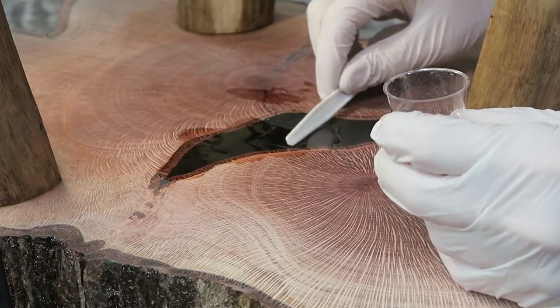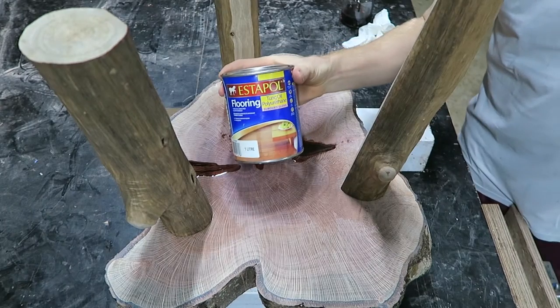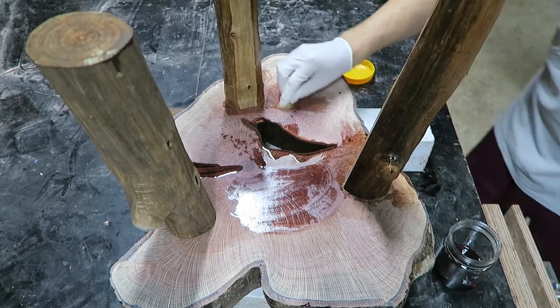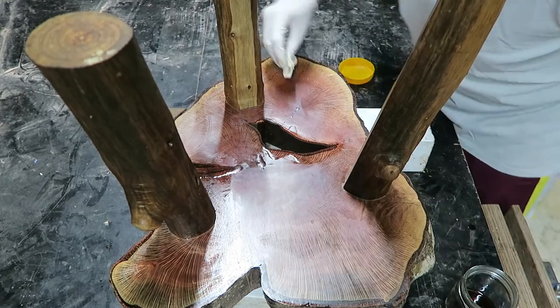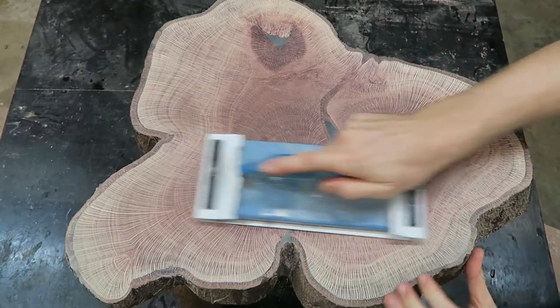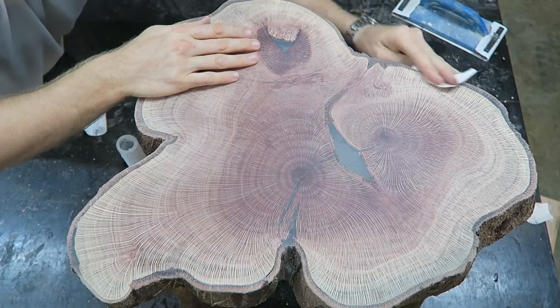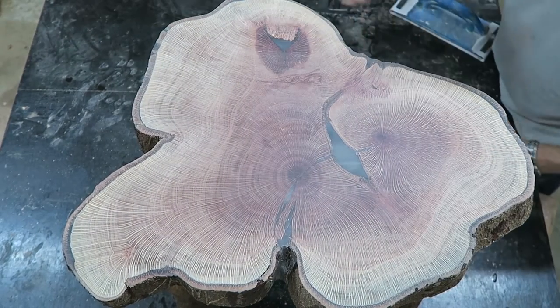To create the glass finish for the cavities, the underside was given a thin film of epoxy over the cast areas. Then the rest of the underside has a normal finish applied generously and burnished off. The top now gets the prep treatment, with the whole surface sanded to 220, the sharp edges broken, and the cast sections polished to 1200 grit.